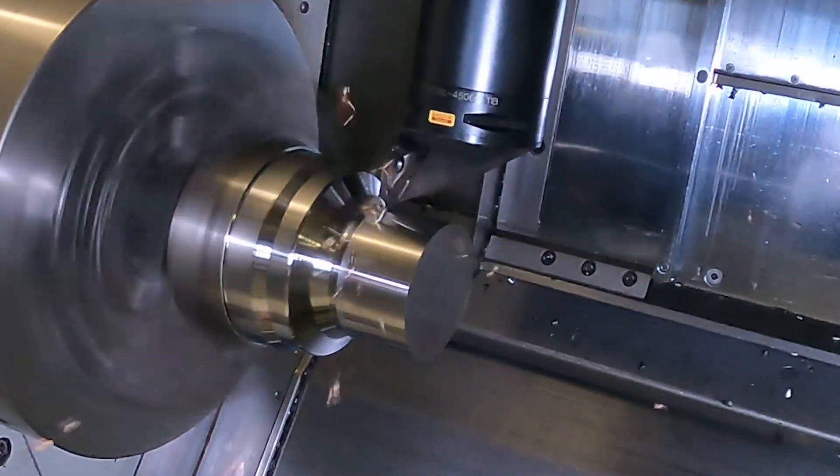Tell us about the demonstration on the screen, the one we've just seen on the Mazak. So this is a 260 Brinell EN24 material, so chip breaking was a bit tricky to start with, but actually we've got really good chip control. We're running at 0.65 millimetres per rev, 2 millimetres depth of cut, and 350 metres per minute cutting dry in this steel material with the new 4000 series grade — great tool life, great productivity.